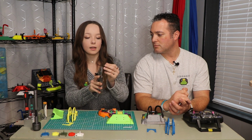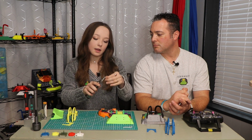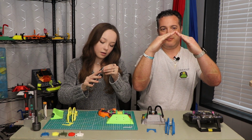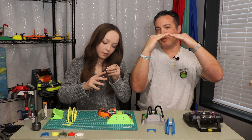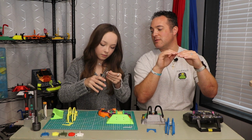So to put a V-bend in, you'll want it just a little bit from the end of it, and you'll just want a slight V-bend. Just a little, maybe 15 degrees, just enough so that when it gets in there, it's got a little bit of a spring that keeps the paperclip from moving from side to side.